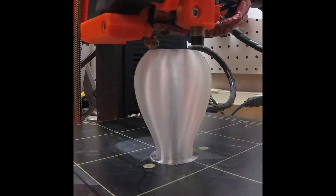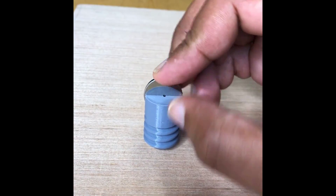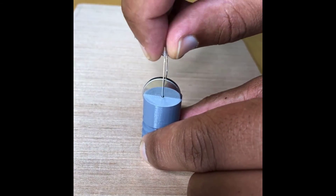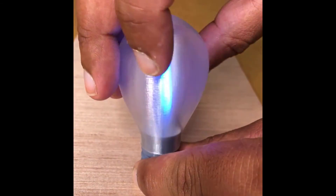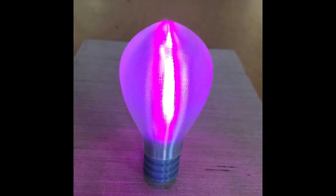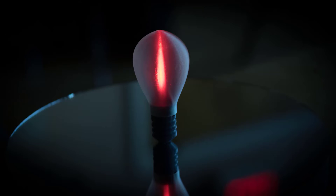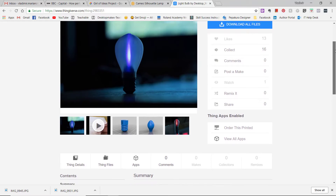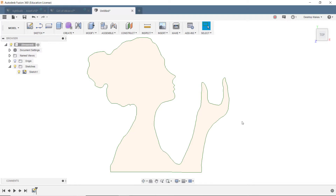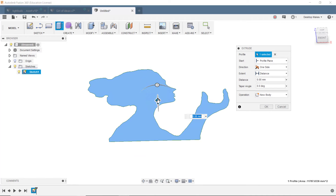Here she is after staining. I 3D printed the bulb using clear PLA — my settings were two shells, zero infill, and 0.1 millimeter layer height for the best results. For assembly I kept it as simple as possible: a CR2032 coin cell battery (3 volts) and a color-changing LED, which makes for a really nice effect. I've uploaded the file to Thingiverse — I'll leave the link below.